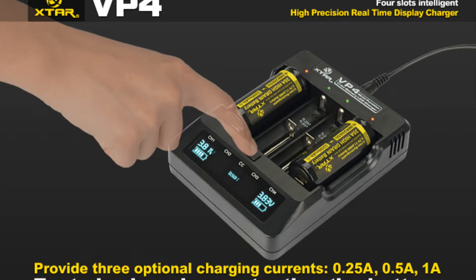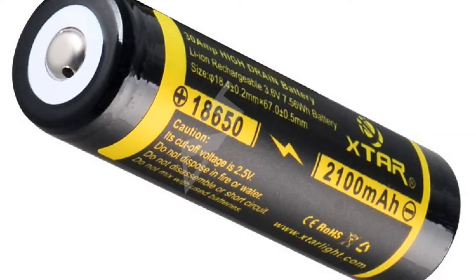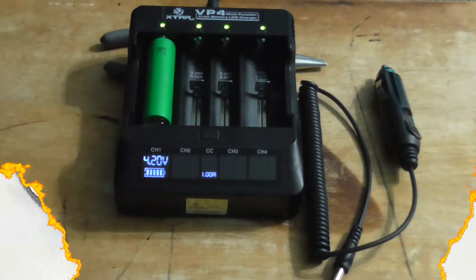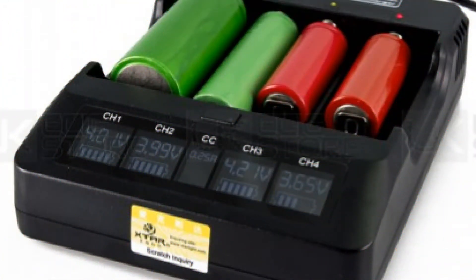You've got three options to choose from for charge currents: a quarter of an amp, a half an amp, and one amp. A quarter of an amp will take longer to charge an 18650 battery than one amp will. You're talking about charge times when you're talking about charge current. It's also nice because it's compatible with so many different batteries — if you're charging a big battery you want one amp, but if you're charging a small battery you want a quarter or half an amp. You don't want to be stuck at half an amp because it has to be compatible with the smaller battery, so it's nice to have that capability.